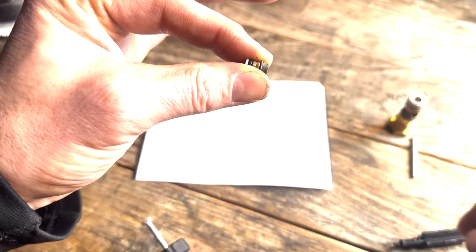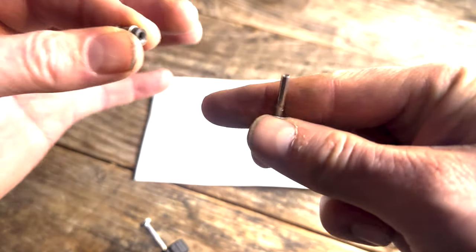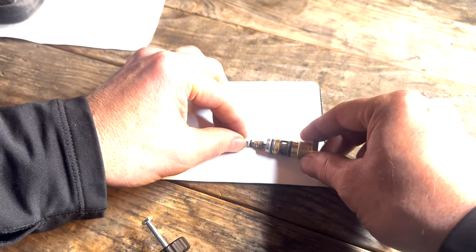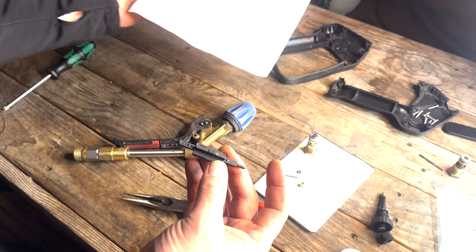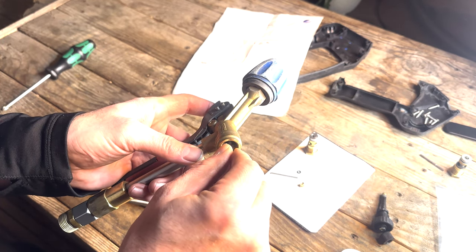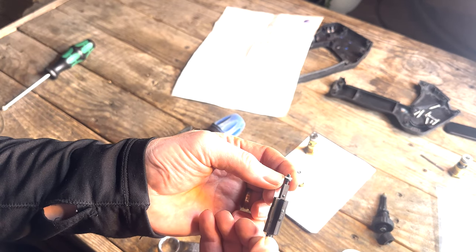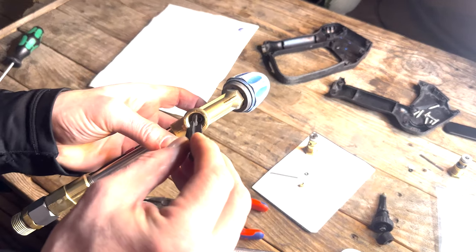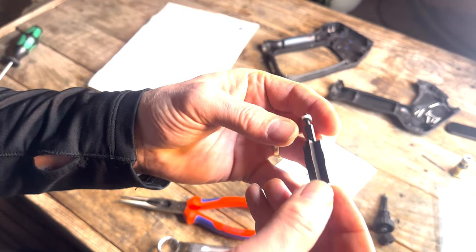Put the insert in there, unscrew everything — the valve with the divot in there — and then screw the valve up tight. And when you press the trigger, it pushes the pin, takes it off the seat and it works. So poke it in — what you're doing is you're grabbing the o-ring. I can feel it grab. There you go — that one's grabbed the little white washer and the o-ring at the same time. It has a little lip on the edge that grabs the o-ring and pulls it out. When you push it in, it grabs the o-ring so that you can just pull them away.